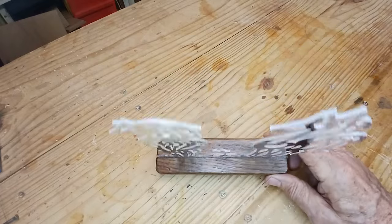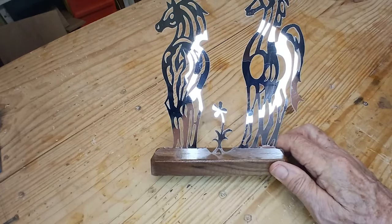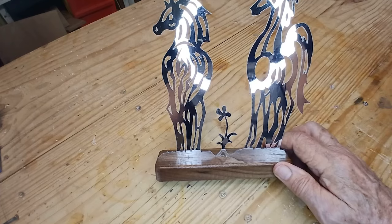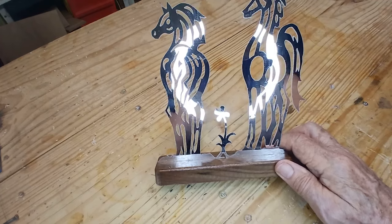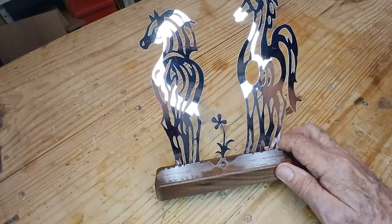It's been sitting here in the shop for a while, and I didn't buy it to cut on the scroll saws, but I wanted to try it. Main thing is not to get it too hot, so I used a number three, and I cut it very, very slowly, the saw at the slowest speed it would run. I thought probably with a smaller blade and less speed, it wouldn't melt it. It didn't melt it. It got warm, and I could smell it, but it cut it clean.